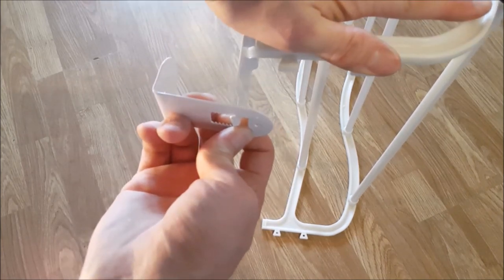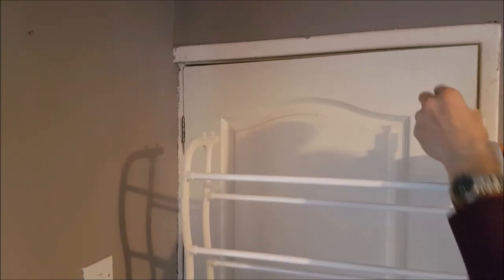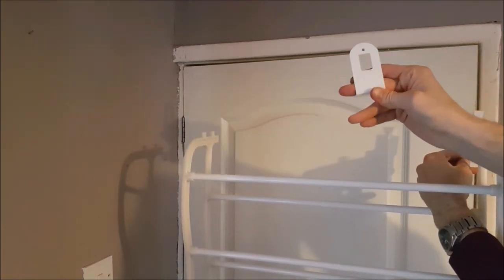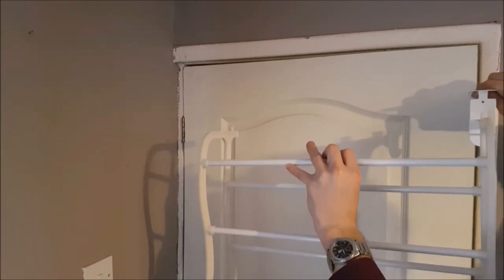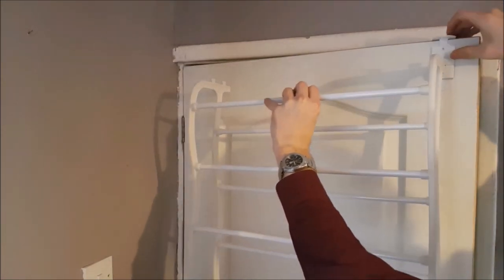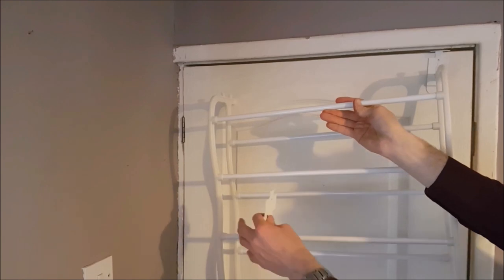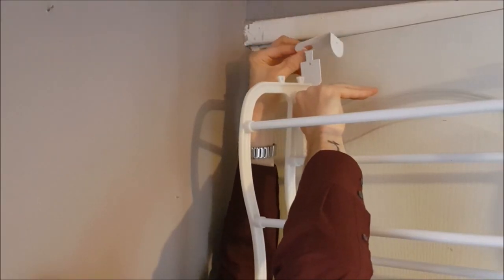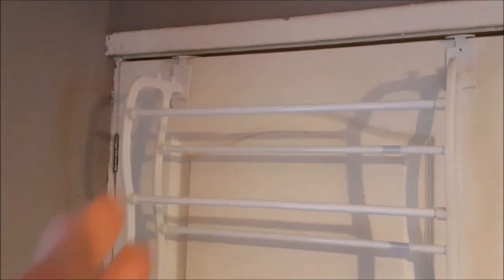We're going to fit it onto the door. Grab the first bracket with the T-shaped hole and slide it in. Try to get a second person at this stage to hold the other side — trying to hold two brackets at once is almost impossible. Slide the second bracket in sideways, turn it, keep the friction pulled up on the shoe rack, move the door slightly, and place it over the door. Then repeat: grab the first bracket, slide the T-shaped hole onto the shoe rack, turn the second bracket sideways, twist it straight, and lift over the door. With the second bracket now fitted, the shoe rack is in place.